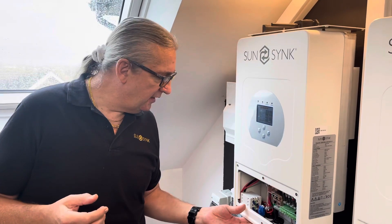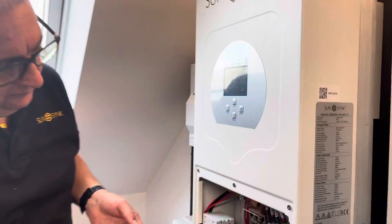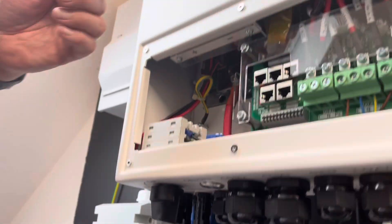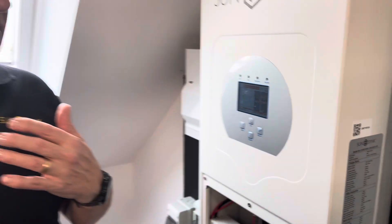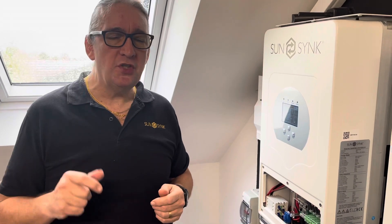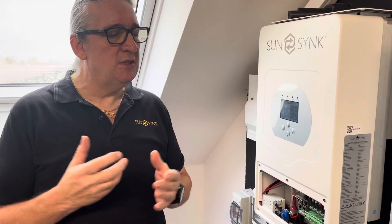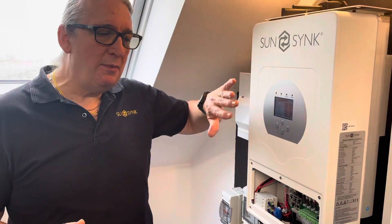One of the things — if I show you — I'll actually switch this inverter off. There's a button underneath here. The inverter is now switched off and the screen will appear normal even when it's switched off, but the inverter will not be functioning correctly. Please make sure you press the on button, because the unit can be physically switched off. This can cause a problem especially if you've got multiple inverters and maybe one is switched off and the others are switched on. The button is underneath, and what confuses people is the screen will be lit up even when it's off.